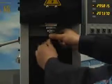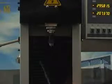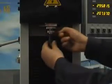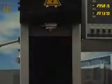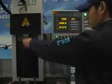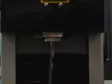Wait for the Z-axis to raise. Electrode leaves the guide. Close Z-axis lock switch. Loosen the chuck and take out electrode. Take out chuck. Plug up spindle hole by hand, then open water pump switch to push out the seal ring.